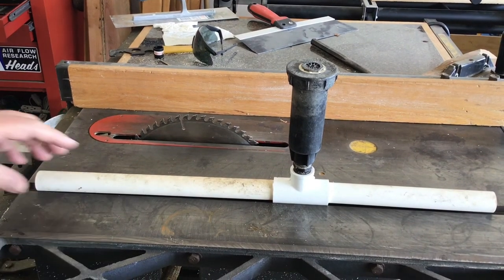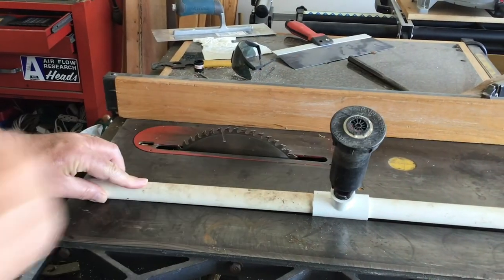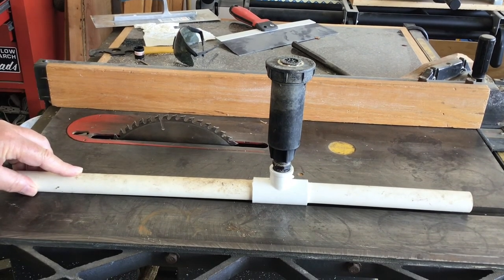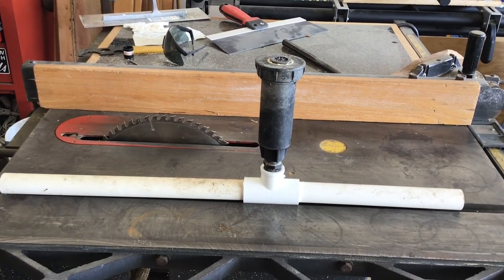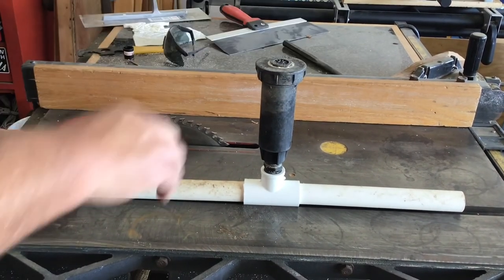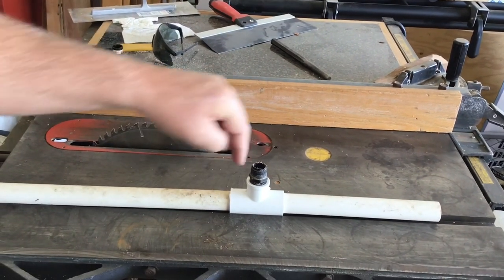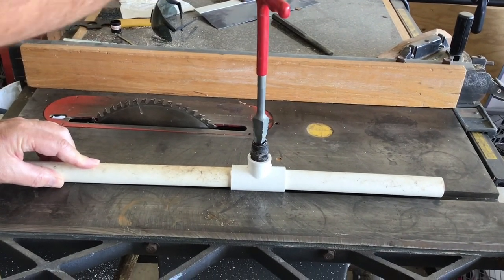I built a mock-up of a standard sprinkler system that you'll commonly find in most areas. The sprinkler head I showed you looking down from the top — this is what it's going to look like in the ground. You'll have a PVC pipe running around the perimeter or irrigation field in your system, a threaded riser in there, and the pop-up sprinkler is threaded onto that. To convert this over to a drip line irrigation for our container garden, we simply dig out some dirt around the sprinkler just enough to allow you to unscrew it from the riser.